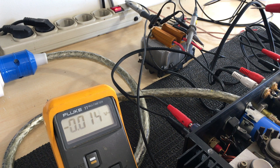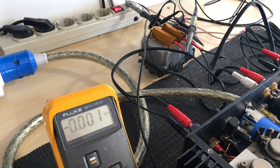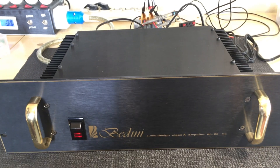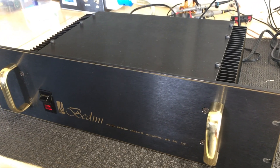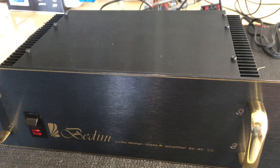When I said I thought it was the transistor, I might be right — that 0.6 volts coincides with the base-to-emitter voltage drop of these transistors, so it might be one that's gone shorted. The problem with this piece of equipment, very similar to the Melos, is that it's very difficult to find information on the web. There is one schematic flying around which I believe is supposed to be correct, but I haven't confirmed it, so I'm going to have to open it up and see what we've got.